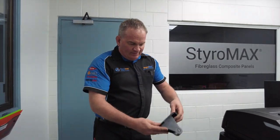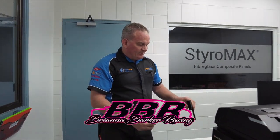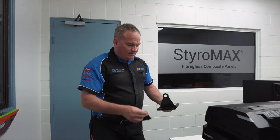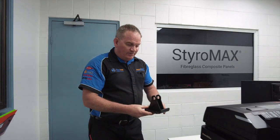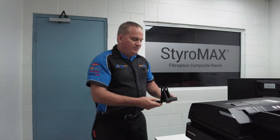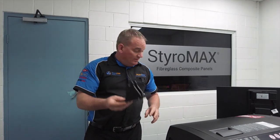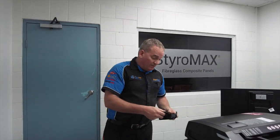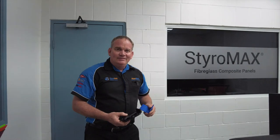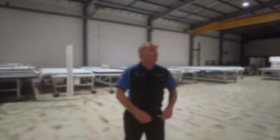This one here is a suspension part for our daughter Brianna with Brianna Barker Racing — part of a traction aid for the rebuild on her race car. We had to develop it to suit the car, so we did it in plastic first to see how it fits before going to the trouble of laser cutting in steel. We design it in SolidWorks, export as an STL file and get it 3D printed. We love it so much we're about to buy a 3D printer of our own to develop plastic accessories for RVs.